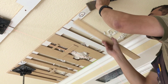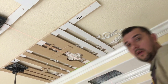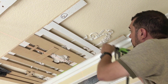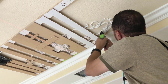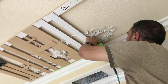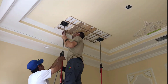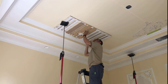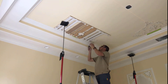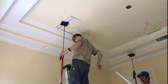This was relatively easy to do, just time-consuming, and the fact that we're working over our heads makes it a little more tiresome. Once I removed some of the strips, I started putting micro nails and getting the feel of which parts were loose, making sure everything had glue and just kept shooting more nails. This following time-lapse shows the whole process with one of the items — it took me probably 15 to 20 minutes to glue it, nail it, and remove the strips section by section to finish off with the end result.